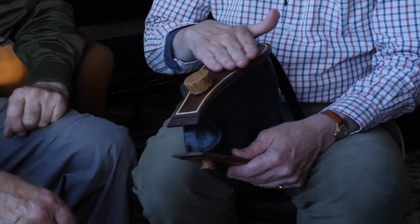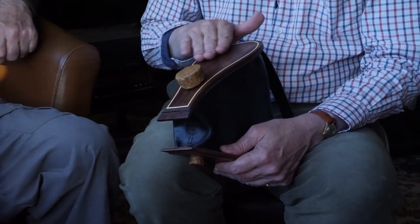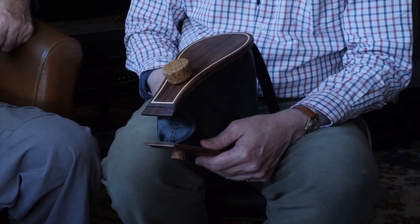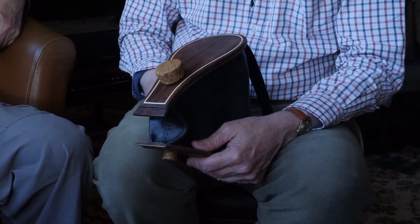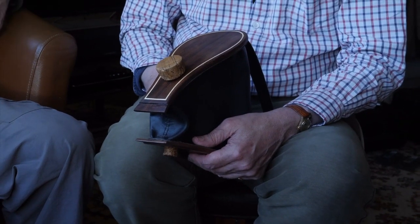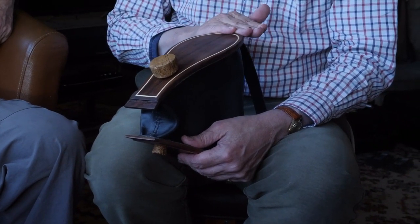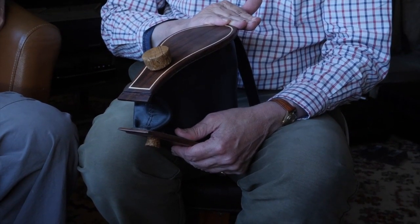And have you treated the wood in any other way at this stage? Have you oiled it? Oh yes, I usually do. When I've sanded it, I'll get it all ready, because the next stage is putting all the furniture on, and that makes it difficult to do anything with. So I'll get as much of the finishing done as possible. So you sand it, then do you oil it before you put it on the polishing mop? Yes, I always let the oil soak in and dry.